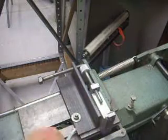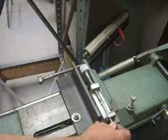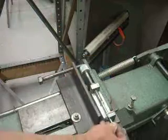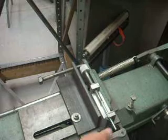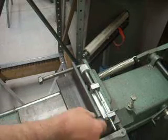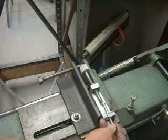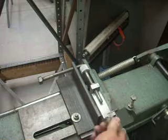There is an alternative way to use this fixture with the bolt up against the stop. Some people like that because then regardless of the length of the starting bolt, they're all cut to the same length. What I don't like about this is that if it rotates, it's tearing up threads that you want to use — it's going to spin and tear them up. So if you use it this way, you really want to manually snug it in first, and then it should be fine.